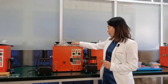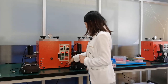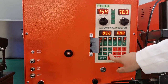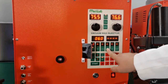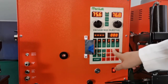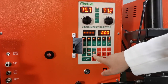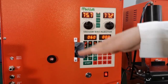This is the old version with the electronic drive inside this machine. We do a simple test. We press program number one, then we press set. We set injection pressure to 60, then enter. The pressing pressure we set to zero, then enter. For the forward pressure, we also put zero, then enter. Then we press set again to confirm the setting. We set the pressing pressure and forward pressure to zero to avoid movement of the clamp.